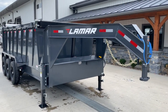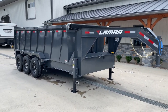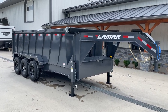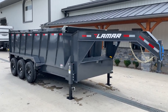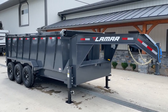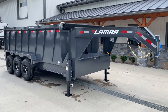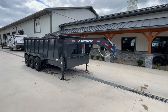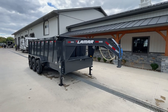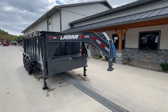Those features other than that on this trailer should all be standard, but we'll take a look at them as we give it a walk around. This is a triple axle, 21,000 GVW, triple 7,000-pound axles. This unit weighs about 6,000 pounds, so 21 less the 6 empty gives you about 15,000 payload. You're also going to pick up somewhere around 20% tongue weight to the goose, netting another 4,000, so legally you can probably get upward of 19,000 pounds in this unit.